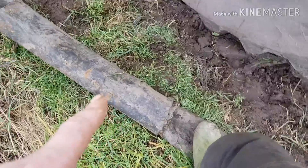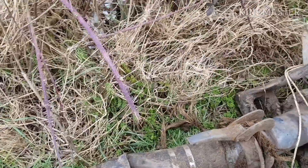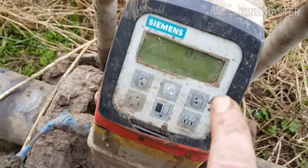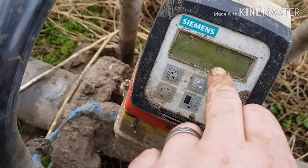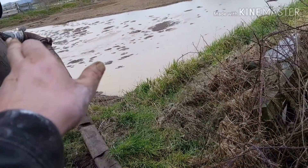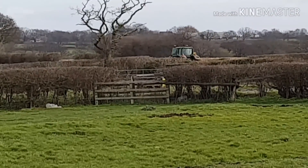When we're pumping, this pipe runs at about 10 to 12 bar - to put that in perspective, that is similar pressure to a wagon tire, a truck tire. Not nice when they go bang, luckily they don't very often. Then we come to here which is our meter. This will be our running rate, measured in cubic metres per hour - we usually run at about 100 to 120. The little one is our job total. We come to a T-piece which, when we come to blow out, we shut the big gate valve on the back of the pump, connect an airline through that compressor, and blow all the poo that way. That's our outlet pipe which runs down to the tractor which has a splash plate on the back.